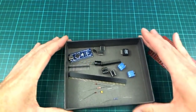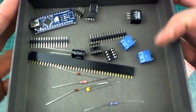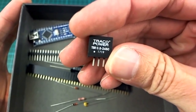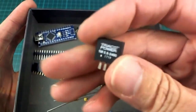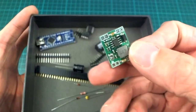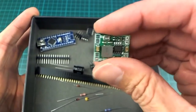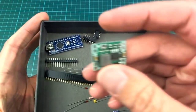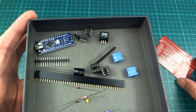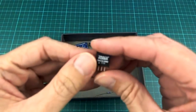There are a couple of diodes, a couple of resistors, a couple of capacitors, a couple of these, and a couple of ICs — a couple of everything except for this Traco power module. This was a little bit pricey. I originally thought I would just use one of those voltage regulator step-down things I have tons of for my Arduino projects, usually stepping down to 5 volts, and a lot of these can handle the 24 volts input the wheelchair would have. But since I'm buying a bunch of things and since the circuit board is set up to nicely use it, I might as well get one of these.